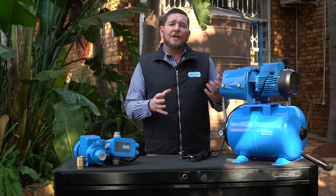It's very bad practice to put a filter on the inlet of your pump, as that will restrict the flow of water — your pump will not be able to move water that it's not receiving. Your filter could also get blocked, meaning your pump will get no water at all, causing a dry run. A dry run is a critical condition and can make your pump fail within minutes.